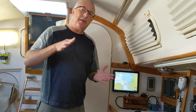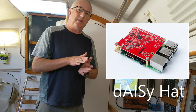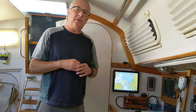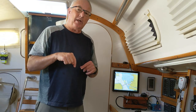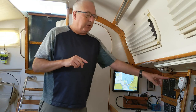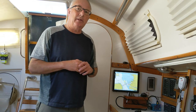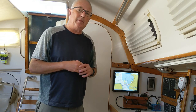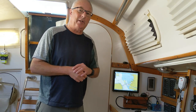In addition to the Raspberry Pi, there's a daughter board called the Daisy Hat, which I bought separately and which plugs right into the Raspberry Pi. That daughter board is an AIS receiver. I took the masthead coax cable and put a high-quality coax splitter on it, so that signal goes not only to the ship's radio but also to this independent AIS receiver — and that's how you get all that ship data. The people that make the Daisy Hat also sell a nice little blue enclosure which protects everything, and I highly recommend that too.